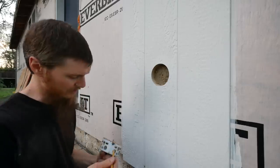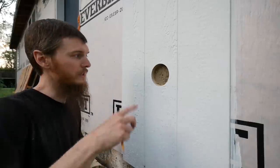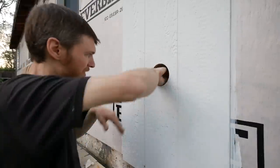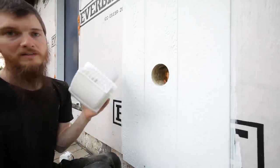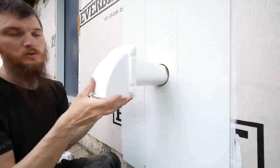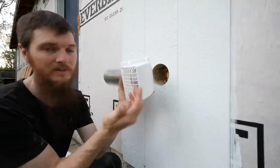There it is. I'm so slow when I work — the whole day gets by. I'm always afraid to do stuff like this, so I really try to plan it out. I want to take out some insulation but not too much. For my air intake duct, I picked up a dryer vent hood for the wall cap and took the flapper out of it so it can draw air in. The screen is a little bigger than I'd like — insects could come in — but maybe I'll put some window screen in there.